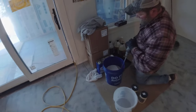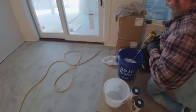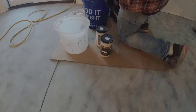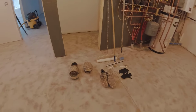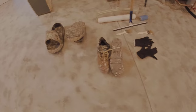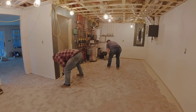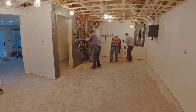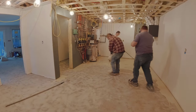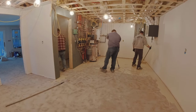Darren's mixing up the coating — we're actually using a two-part poly aspartic today from Deco Crete Supply in Ohio. Poly Armor 90 is what we're using, and we're adding their pigment to it, so it's going to go down kind of tan or beige in color, and then we're going to broadcast the flakes into that. Here's some of the equipment and tools we use: we wear spike shoes, use a squeegee to move the poly aspartic around, and then an 18-inch roller or 4-inch roller and brushes to do all the edges and main rolling parts of the floor.